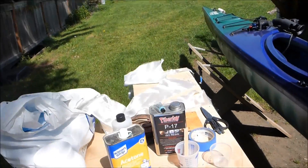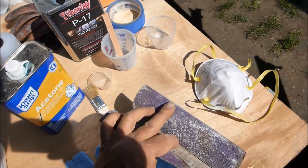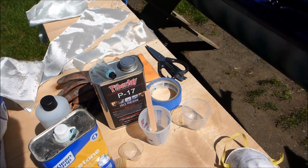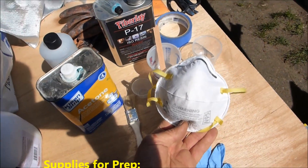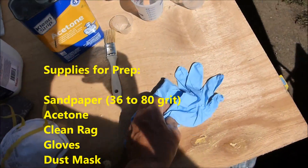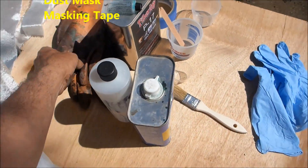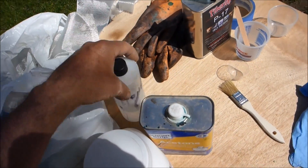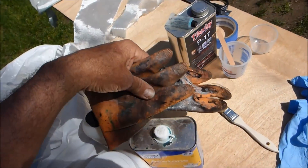This should work for any punctures you get in the hull. To start, you want to prep the area with sandpaper — I'm using 36 grit heavy-duty, but anything from 30 to 80 grit will work for prepping the surface. You want to use a dust mask and a pair of gloves. Then wash the area down with acetone. Acetone will eat through thin painter gloves, so you want a more heavy-duty glove.